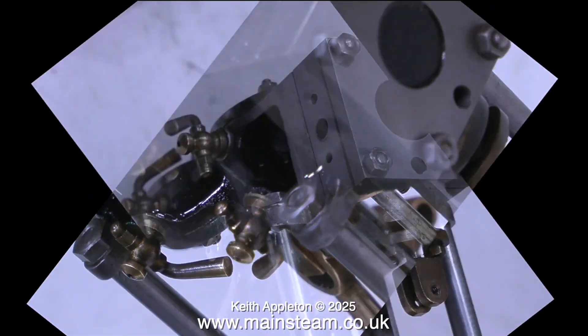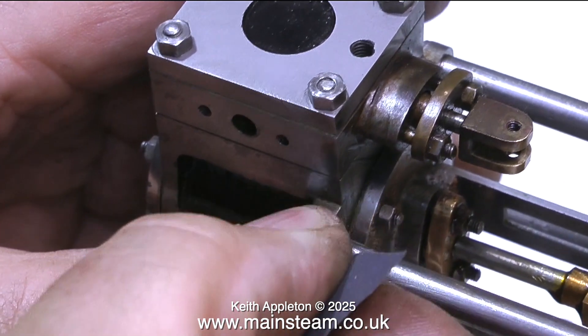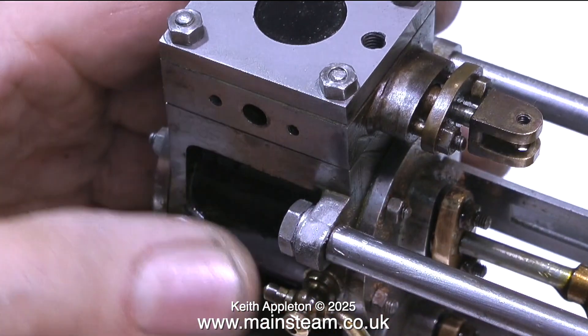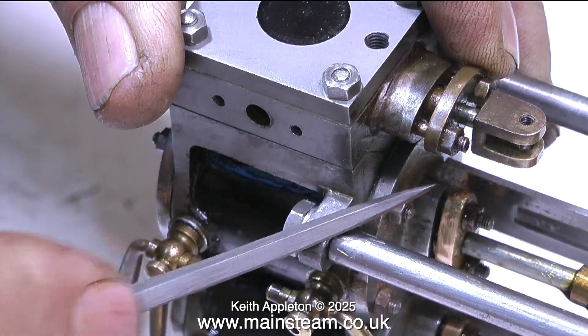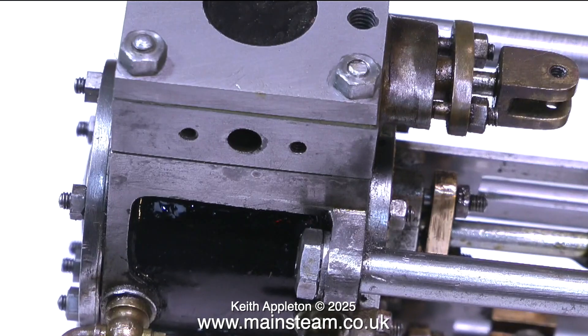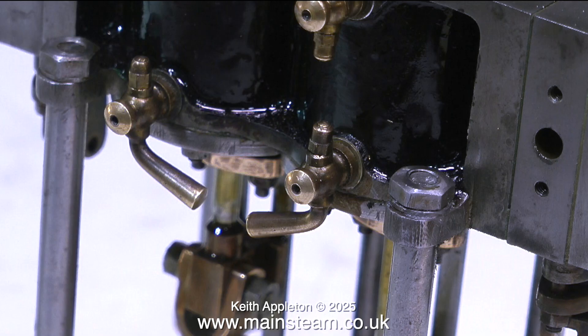The first thing I'm looking for when I tighten up the nut is to see whether the JB Weld has cracked. I rub it down with some sandpaper to check — and no, it hasn't; it's all in one piece. So now I'm having a filing test just to smooth it out and see what it looks like, and the broken part is very well secured to the rest of the engine. This is really good stuff. After filing the repair smooth, even the JB Weld took on the appearance of the parent metal. If you look carefully you can see it's a repair, but I've seen a lot worse than this.